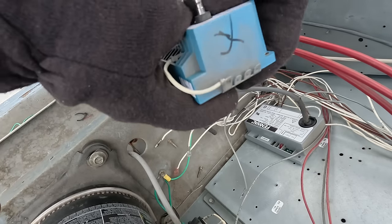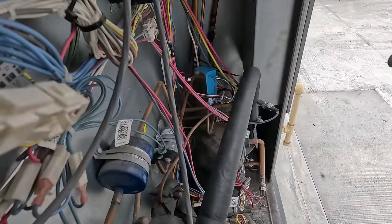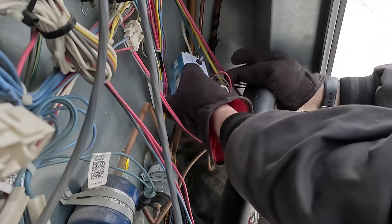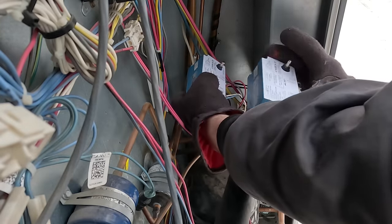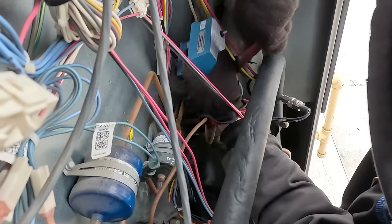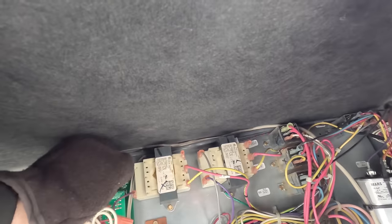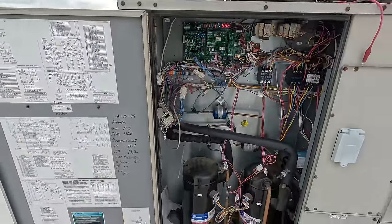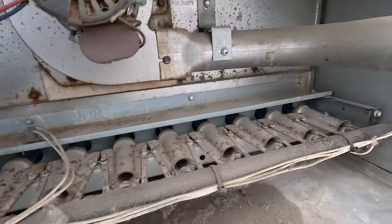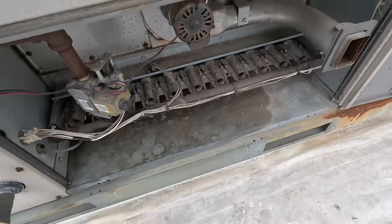Let's just go ahead and swap this out — I think it's bad anyway, just the fact that it was replaced. Let's see if it'll work. The biggest problem I see with this is the ignition wire is super short. When you get it loosened up you can kind of jump it over to the other — these are the same units. Let's go ahead and just swap wires here and see how it does. Let's turn on this disconnect box. Let's give it a sec and see what happens. Purge motor just came on — I heard it click.